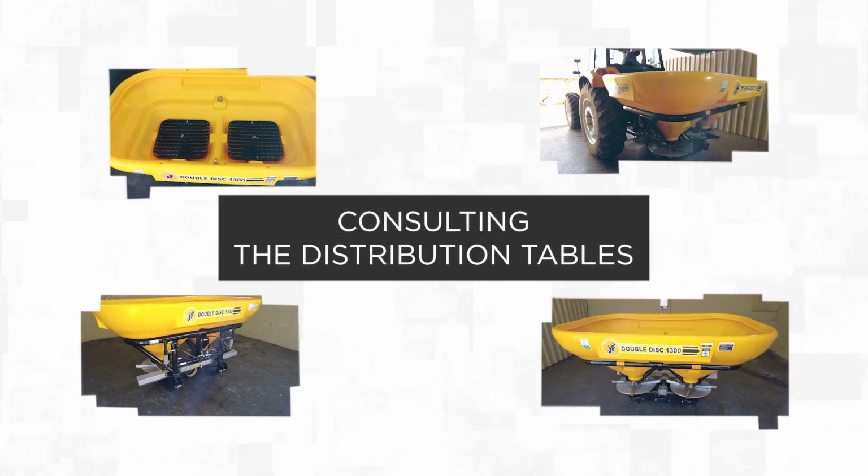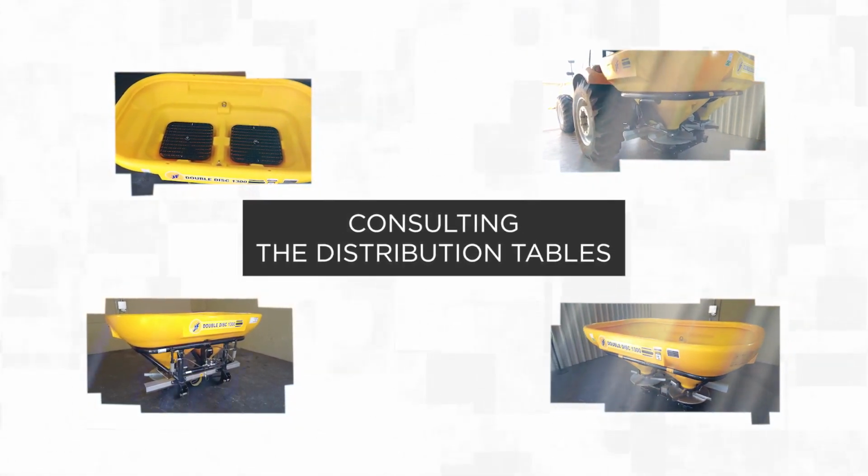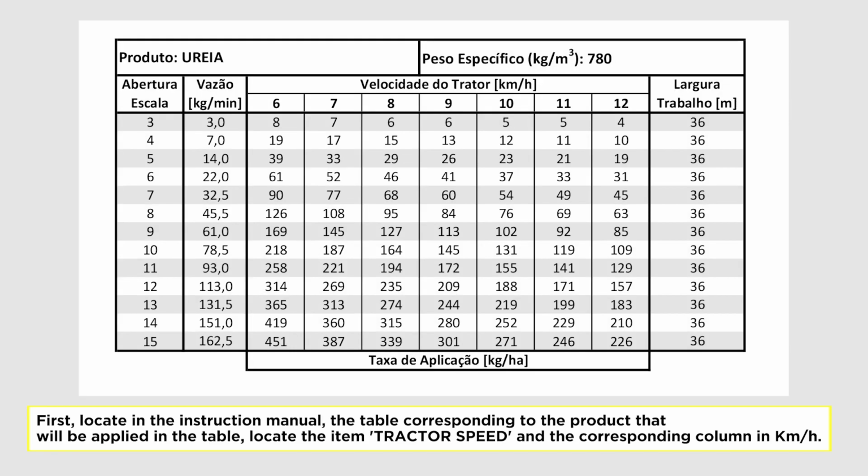Consulting the distribution tables. First, locate in the instruction manual the table corresponding to the product that will be applied. Locate the item tractor speed and the corresponding column in kilometers per hour.